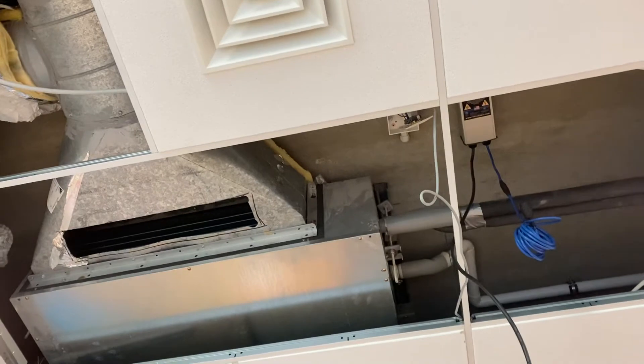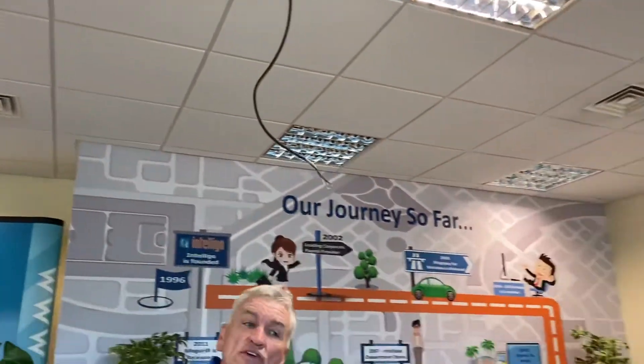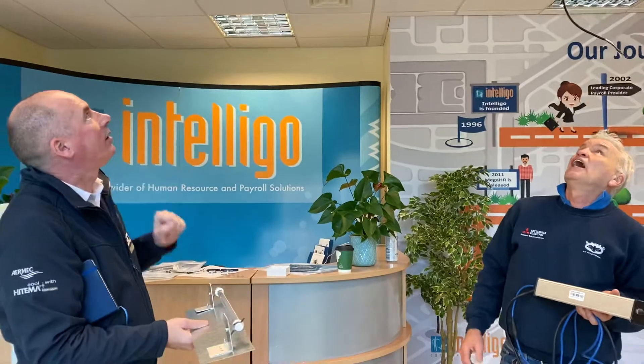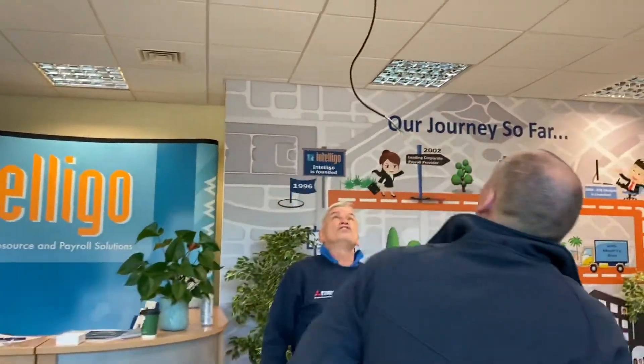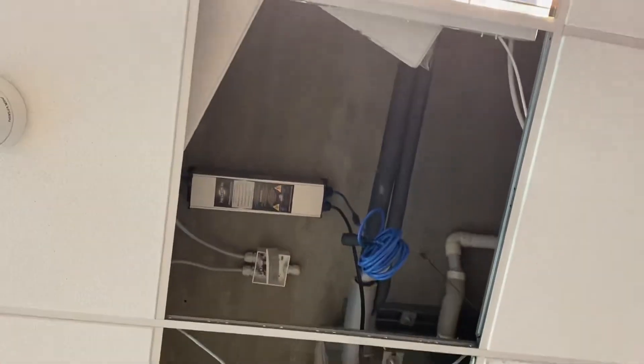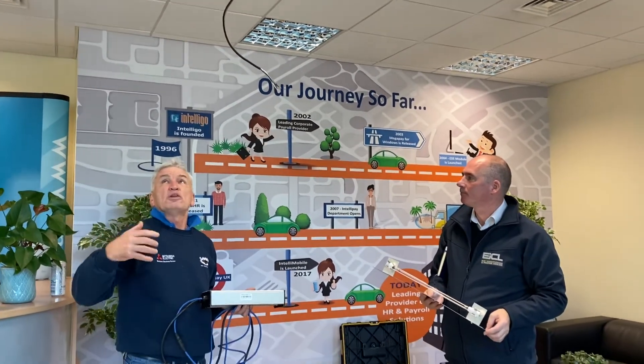You see the hole there? Yeah, where the flex comes out on a gland, and there's also a hole for an inspection sight glass that goes in as well. This is the sight glass so you can see if the lamp is operating — that goes into the side of it. Then there's a control unit mounted up here on the ceiling, just up on the ceiling. So you have this connected back to a power supply on a timer? Yeah, on the board — on a timer so the lamps will only be running when the fan coil is running, timed the same time as the AC.